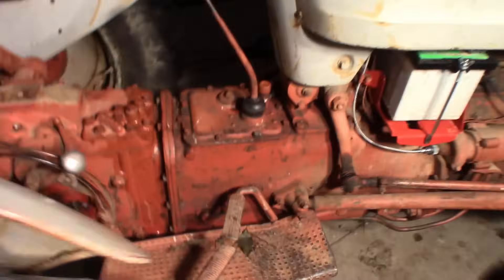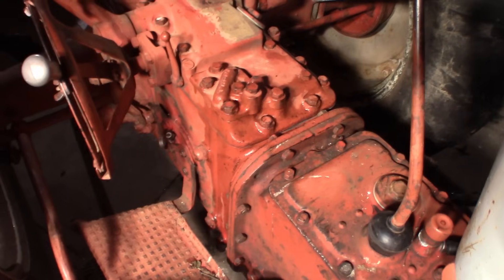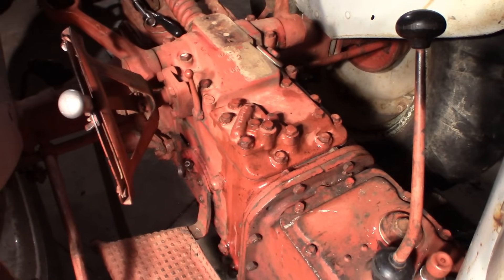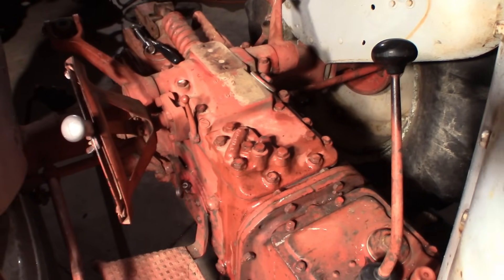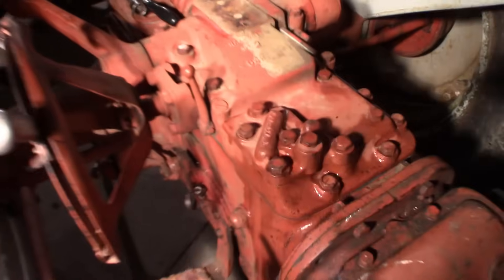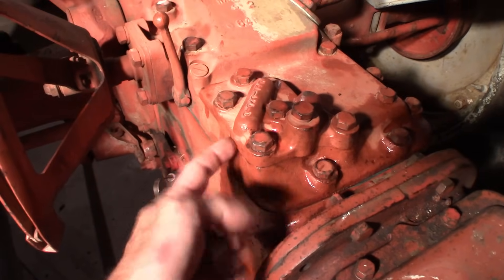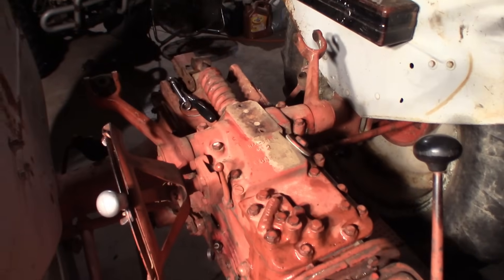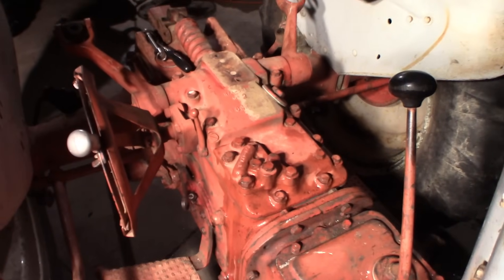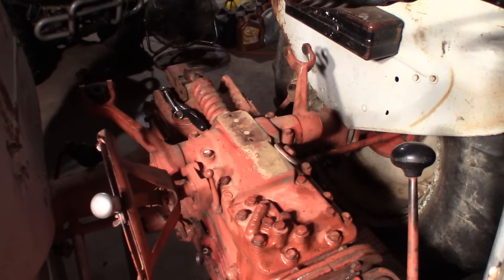There's the top cover back on. I did already run the tractor — I was going to do it with the camera on, but being in the garage it's going to be too loud to really hear. Lift went up fine, goes back down fine. I don't know if it drifts or holds for sure because there's no brush hog on it, so I won't know yet until we get the brush hog to make sure it's completely fixed. The important thing is there's no fluid leaking from here, because this ridge here is where the fluid comes up into the top cover, and we're good and dry there. So the only thing left to do is put the seat back on, hook the lower links back up to it, put the brush hog on, and give it a try. Hopefully this took care of my drift issue.